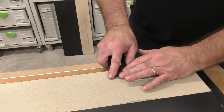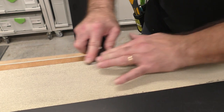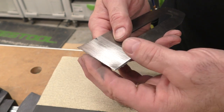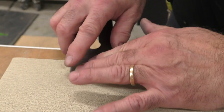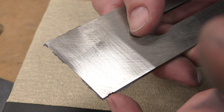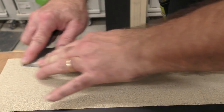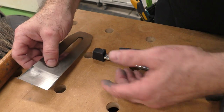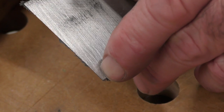I'm going to take it here and hold it — I just need to do the first half inch or so. I'm actually filling the burr in the front of that, but that's not where I care about. I'll take it to 120 just to lap the back — on the flat I can do it really quick. I have to grind the bevel back at least 2, 3, maybe even 4 millimeters so it has travel on that frog with the fine adjuster.